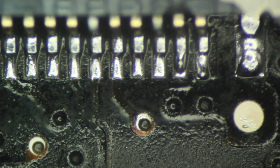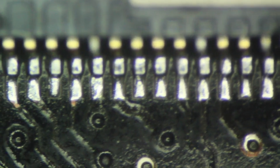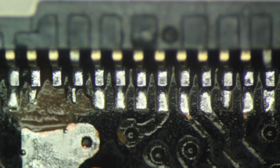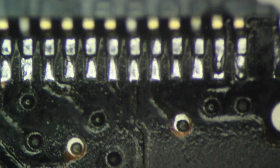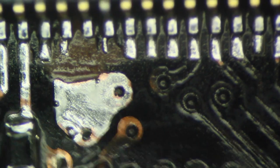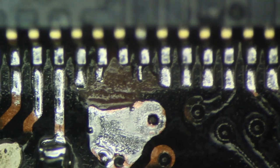So this is after the soldering process. We're using the soldering station, just dragging each pin to connect to your soldering pad. After soldering, you should make sure that two pins are not connected together, and also make sure each pin sits right on your soldering pad.